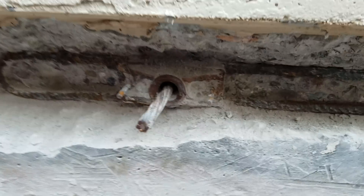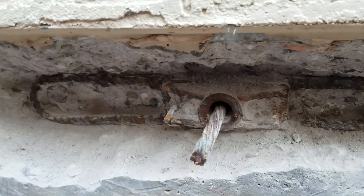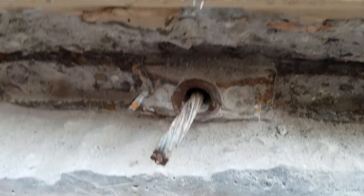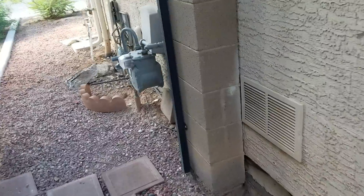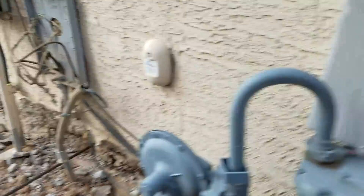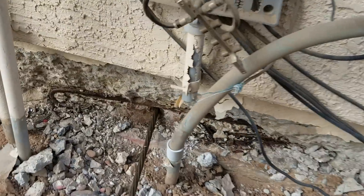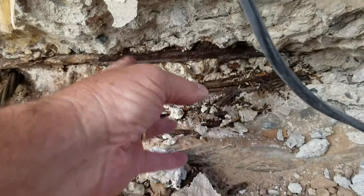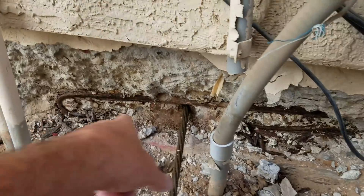We do need to relieve tension on this cable, which we have — it's got two collars that hold it in right there. Let me show you what's happening to a lot of these post-tension foundations here in Arizona. They're just busting out on the inside like this. This side is completely gone — you can see all this rust. All of this rebar is just totally gone. We're going to replace it with new pins in here.